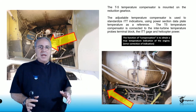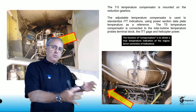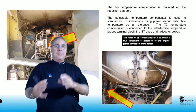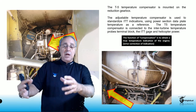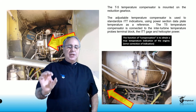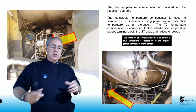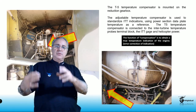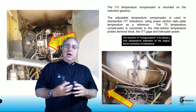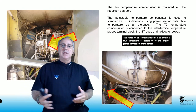The reason why we're going to have to do this kind of calibration is because the Twin Pack is made by Pratt & Whitney and the airframe is made by Bell. They have to have some kind of calibration so that when the pilot is flying the helicopter and looking at the ITT in the Bell cockpit, he sees a true temperature of the engine. That's why Pratt & Whitney created this system — and this is something that we as mechanics or engineers need to check or calibrate every time something is altered.